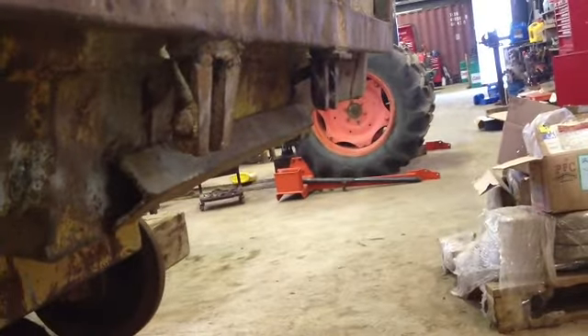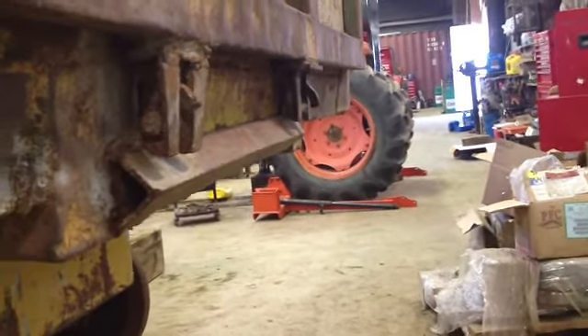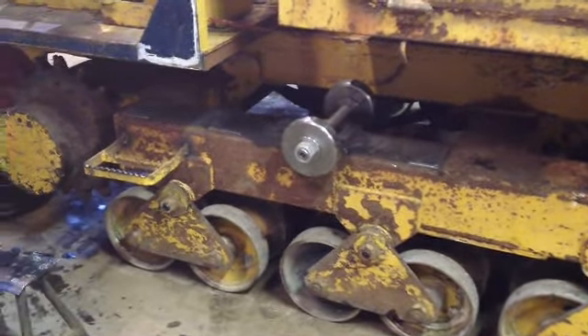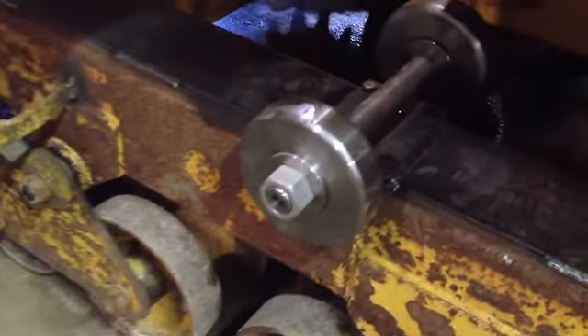And the tailgate latches. These are the little hooks for the tailgate latches that quite often need to be replaced — just make them out of a piece of steel. There's one that was original, which is still good, and here is the new one that's been made up. This particular model had a single top carrier roller — you can see the four mounting holes there. We have moved the one back and added a new one to the front, which are the ones that we manufacture and will supply.